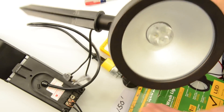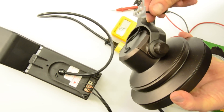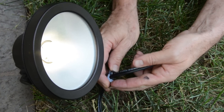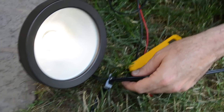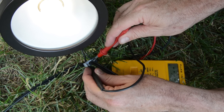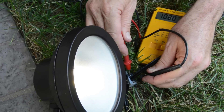The LED fixture has no light bulbs to change and lasts upwards of 50,000 hours, so it will last a very long time in your yard. The fixture comes with a quick connect — we're going to connect it to the main feeder line now. Just push the connector together to make contact. Out in the field at 50 feet from the transformer with two lights on, we're measuring 10.79 volts — we've lost a little voltage but nothing near being a problem.